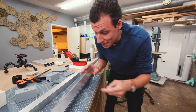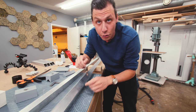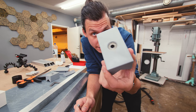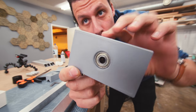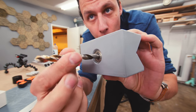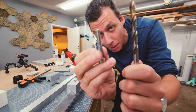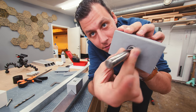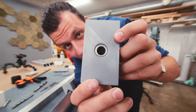I've marked up all the locations for where I want to drill the holes in these tubes. Since I want these tubes to face each other diagonally, I'm going to have to drill the holes diagonally through the tubes. To help achieve that I've 3D printed these guide blocks, which are essentially just a V-block. In one I printed the hole big enough to fit a couple of bearings which happened to fit the size drill bit I'm going to use. I made one guide block for the threaded part and another for the bigger drill bit for the screw head to fit through.